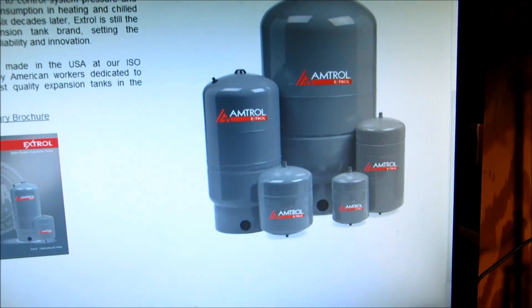Whenever you have a relief valve blowing on a heating system, the first thing you've got to check is the expansion tank. Is it full of water? The diaphragm type might be bad — that's something you need to check. Like I said, I'm going to do a little series and go over the different parts of the system and what I do when I come across different situations. Hopefully this video helps a couple of guys.